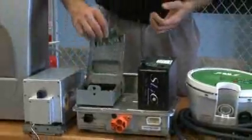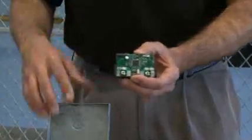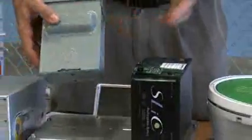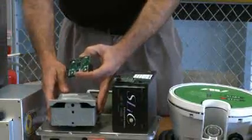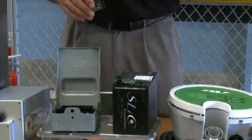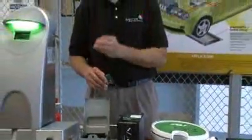Some units have a metering circuit inside of them; some units have an external one that is owned by the utility. Much like a regular full-size meter, it has a submeter. Submetering is an important part of the smart grid and the way utilities can bill out energy distributed to the electric car separately from energy delivered to the rest of the residence or to the business.